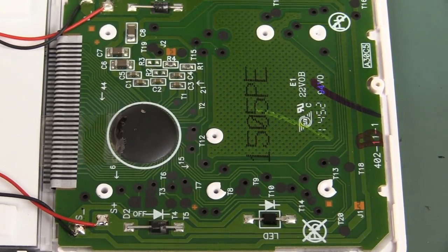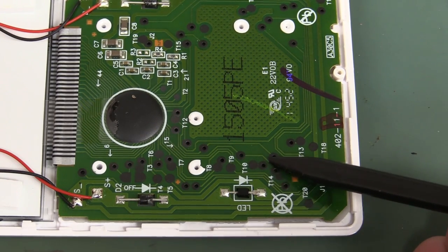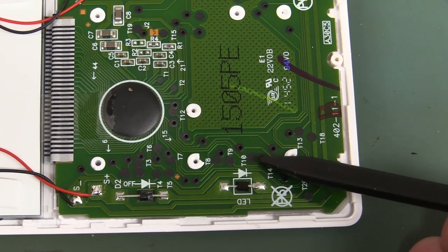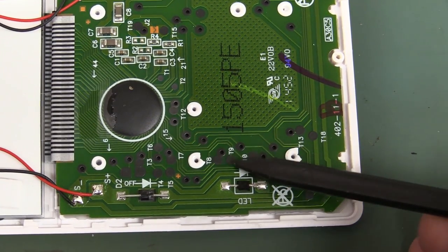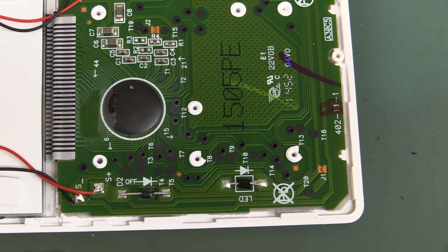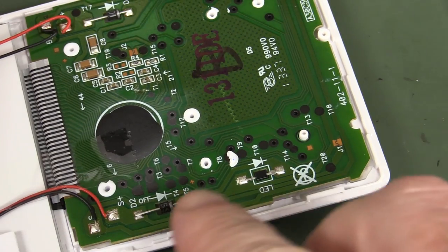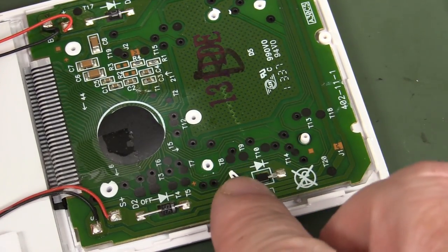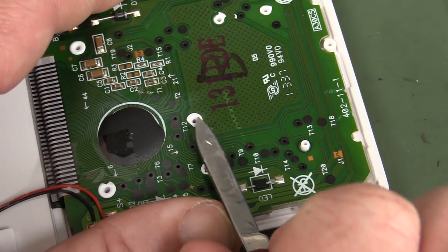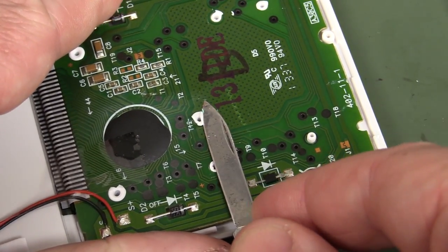We've just got the main IC chip on board. It's just been blobbed, and somewhat annoyingly and not really ideal for the purpose, this model has the carbon covered copper pads here. So these are vias here, and individual little test points there, very nice all the way around there, but yeah, they're covered in carbon, so you have to scrape those off to be able to solder to these pads and vias. And this one's a little bit annoying, it doesn't have screws holding it down. It's got these PCB heat stakes here, but you can just get a knife in there and shear those off. But yeah, this is not the best calculator for this job.